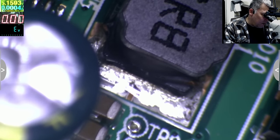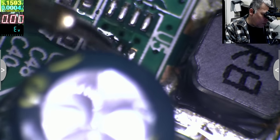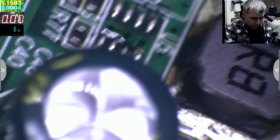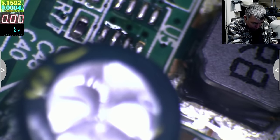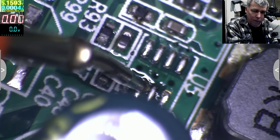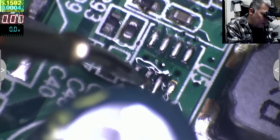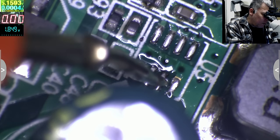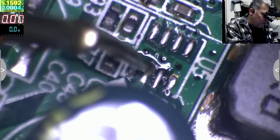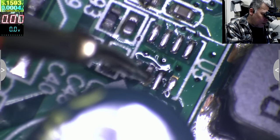Okay. So I've been wrong. This pin is driving. This is ground. That's ground. Let's find out the plus. So after the fuse, I'll put one probe. After the fuse, because the fuse is burned. Now let's see which pin. This one, this is plus 12. The coil is to plus 12? It's not. Okay, that's crazy.